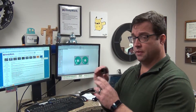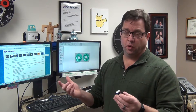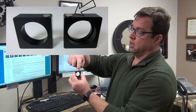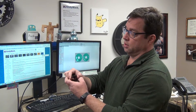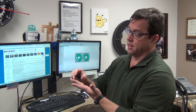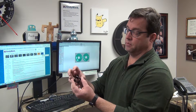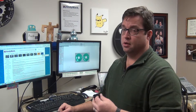We put some magnets in the dart. The magnets are to flag hall effect sensors that are at each end of the dart — they're glued into this pocket. Sometimes the magnets are sticking out a little farther than they should. This one's good — it's nice and flush and smooth. This one you can feel the magnet sticking out. Some people are trying to file or sand this down. Don't do that — it messes with the magnet. If you want to fix this, you can file the backside of the block; it moves the block over a little bit. The concentricity of that hole in the tube is a little off. The best thing to do is just contact us at sales@andymark.com. Let us know if you have one that's bad — we'll send you a new one.